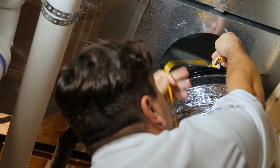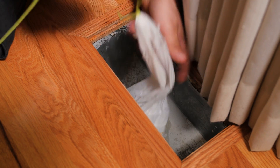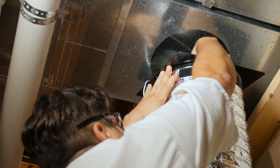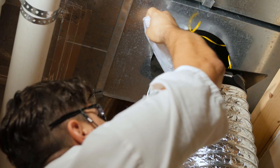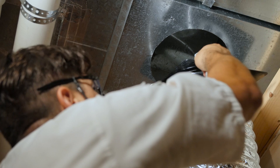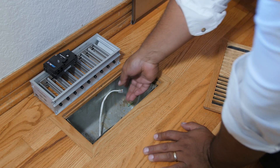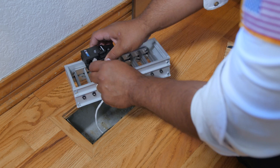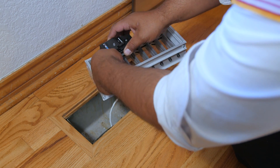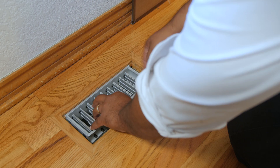In some instances, the balloon may get stuck in the duct, and we may not have enough surface area to draw through. Here we use a simple grocery bag tied to the string, which will eventually draw our wire through the duct system as well. And now we're going to repeat the process for each one of the outlets that we've closed off. And here we're going to install the damper. Now that we've pulled the wire through the duct system, we have our cord.